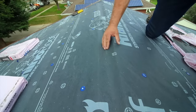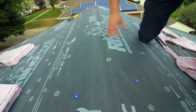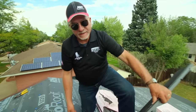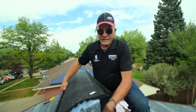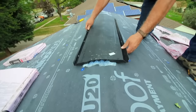You can see that it's open about three and a half inches — that's what you want to have on this peak. You're drawing air up through these vents. Now, there are a lot of cheap ridge vents out there that come in rolls and they're real spongy and mushy. We really like the snow load type right here. They've got a vent covered by fiberglass screening, and this unit sits right down on top of the roof.